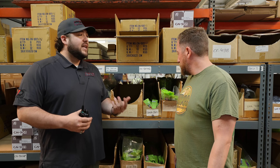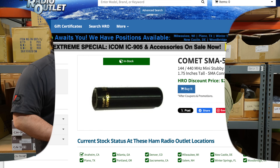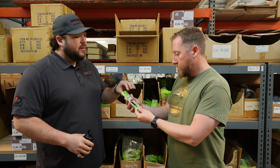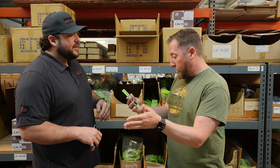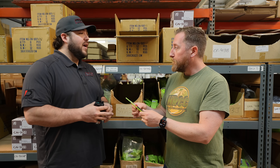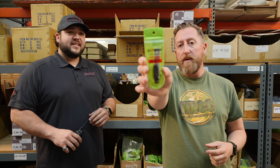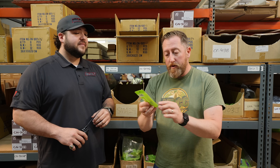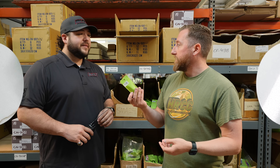For guys who love stubby antennas, we have the SMA 501. This is our very wide band antenna — it covers 118 MHz through 250, 360, 440, 800, all the way up to around 1300 megahertz. It's primarily a receive antenna, since no single radio transmits across all those bands. A lot of people use these at home with their HT on low power for hotspots doing digital modes. It's what we call our stiff stubby model.